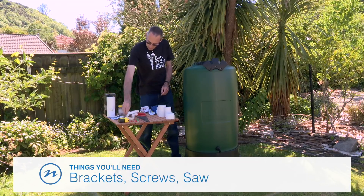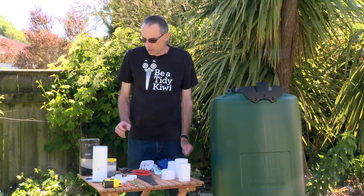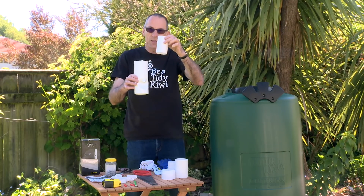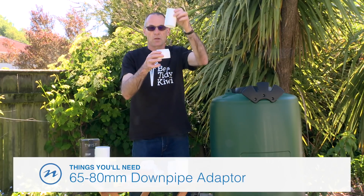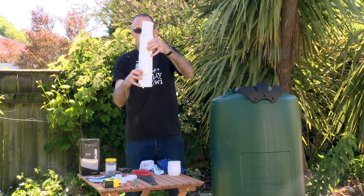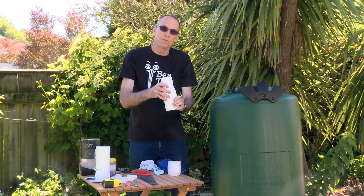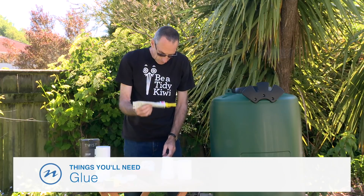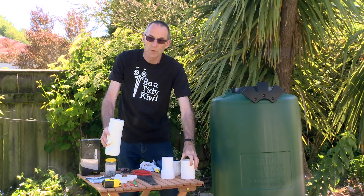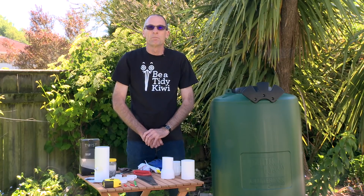You also need some brackets, screws, and a saw. Sometimes you'll find that the downpipes on the house are a different diameter to the rainwater diverter. For example, here a 65mm downpipe, which is very common in most houses, doesn't quite fit. But that's easily solved with an adapter — the 65mm downpipe fits in there, a little piece of 80mm, and then we can connect into our rainwater diverter. All this stuff is readily available from hardware stores. You might also need some glue to glue it together. If you're using an 80mm downpipe, you don't need any glue — they fit together without glue. But with these adapters, you will need some glue just to stick them together. It's also a good idea to have some gloves to keep your hands away from the glue.